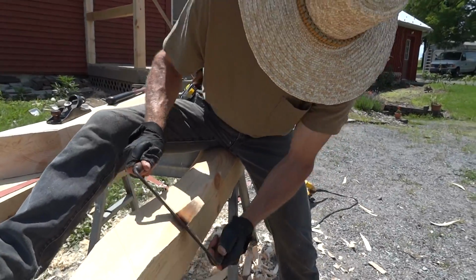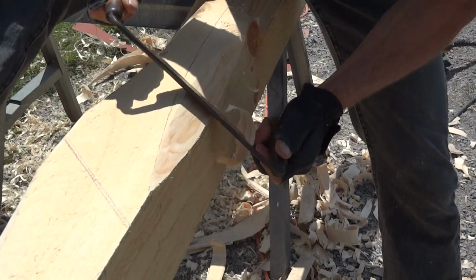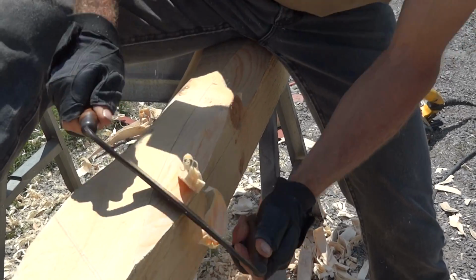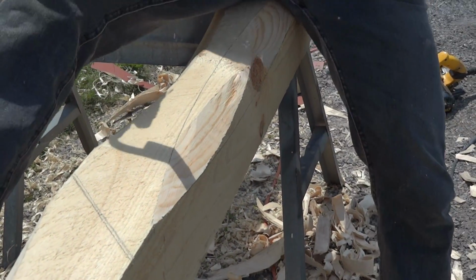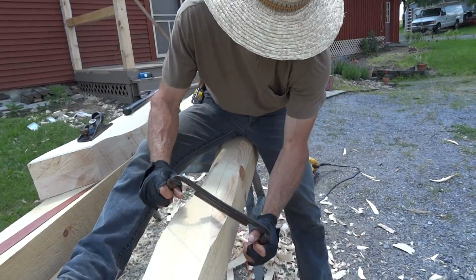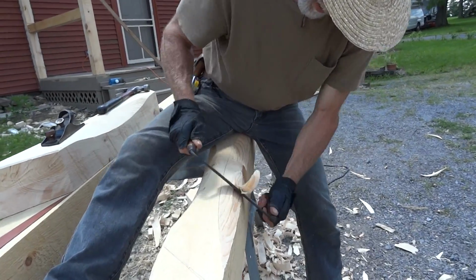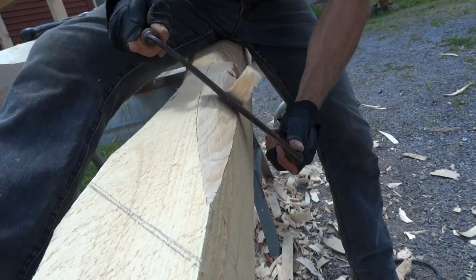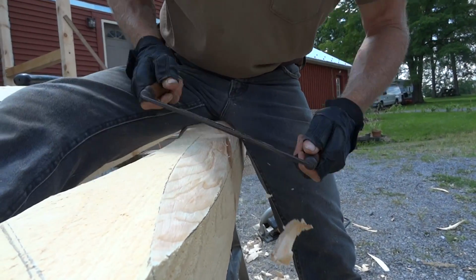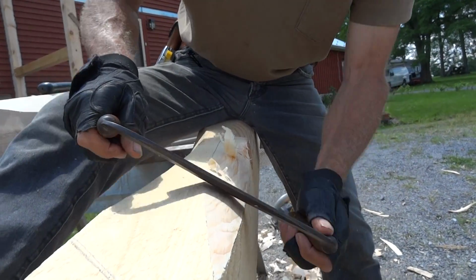So now I have to come back the other direction. And I make this end nice because I don't want to touch it again once I get it. You're feeling out how much it wants to rip and how much it'll stay solid as you carve. That lets you know how much to change the angle. Oh, I see. Yeah. Now this knot is going to be a good example of why this can get difficult. Time consuming anyway. Just right, just take that line and just barely away.